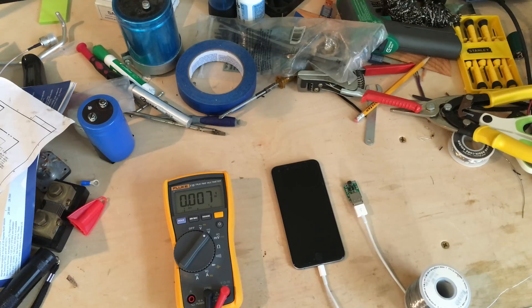What I have set up here is a demonstration to show you why it's necessary to use those resistors. What we're going to do with the resistors is create something called a voltage divider. A voltage divider uses two resistors between the positive rail and ground. You use the pins in the middle of the resistors to generate a voltage that's lower than your input voltage. There are a couple of drawbacks: you can't draw very much current from it, and you have to use higher wattage resistors if you want to draw any significant amount of current.